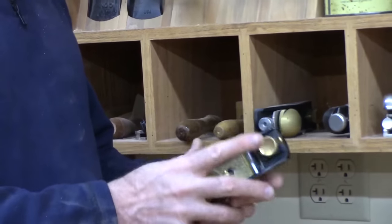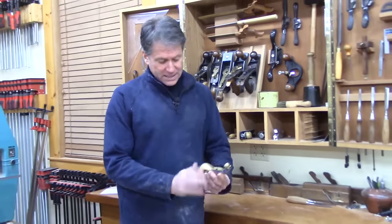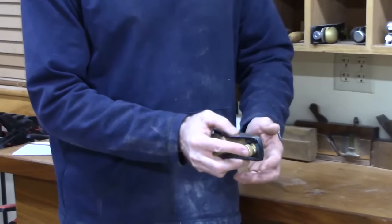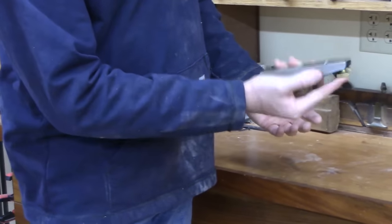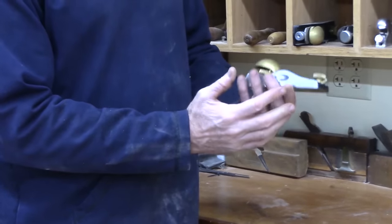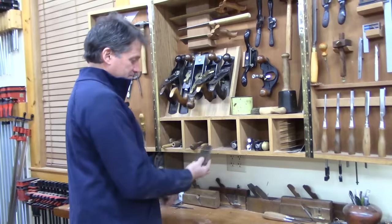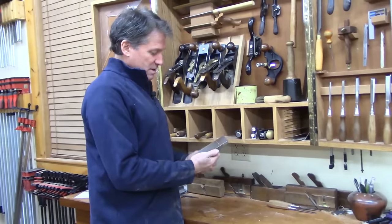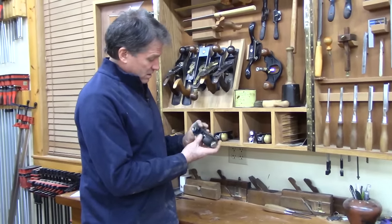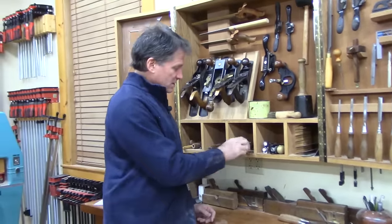It's for small work — you create little chamfers on the ends of things. The brass knob fits in your palm and you hold it in the little indentations on the side, and your index finger goes into that little cap. It's just like an extension of your hand, and you can do incredible detailed work with it. It's a sweet, sweet tool. If I was going to get one block plane, I'd grab that one. But I happen to have two of them — I keep one a little more aggressive, and I keep this old Stanley for even heavier, more aggressive cuts.